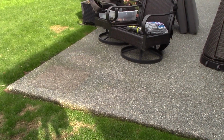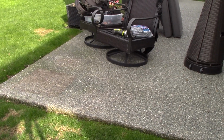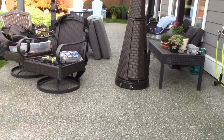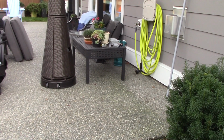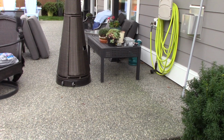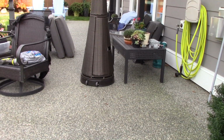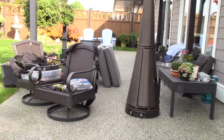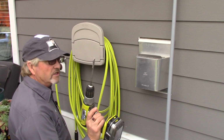Let's go. And just a quick shot here of where the tub's going to go, right out to that front corner of this patio area. They're going to cover this deck with a nice aluminum awning with a glass top. And that's where our disconnect I was showing you is going to go. So we've got the clearance we need between the edge of the tub and the service disconnect so that you can't reach it while you're in the tub. Give yourself a shock, although that's what GFI protection is for. Nonetheless, code rules.